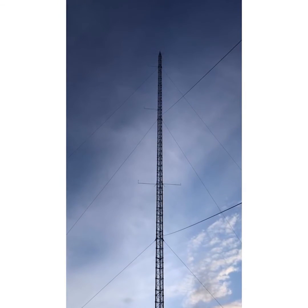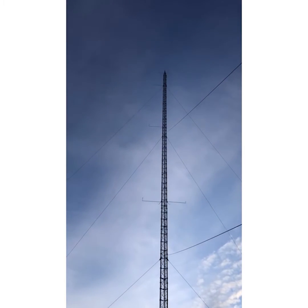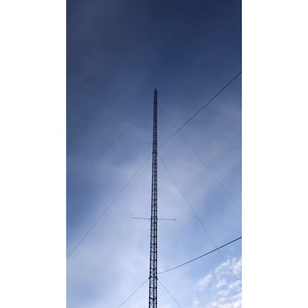You can see the four different measuring heights with instruments at locations where you have those booms going out of the mast to the left and to the right. And at the very, very top of the metmast, there's a single cup anemometer. Now, I'm a bit curious because normally there's going to be a second instrument, which I have not mentioned, and it's called a LiDAR.